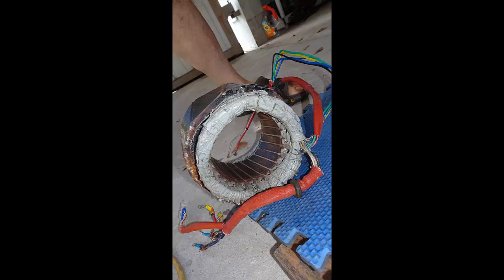Fortunately, we have removed the battery charging windings, therefore I'll have more room to deal with the protrusions at the ends and the actual number of wires in each slot. So that'll make this job a little bit easier by getting rid of those battery charging windings. So this concludes the discussion of physical considerations for rewinding this generator.